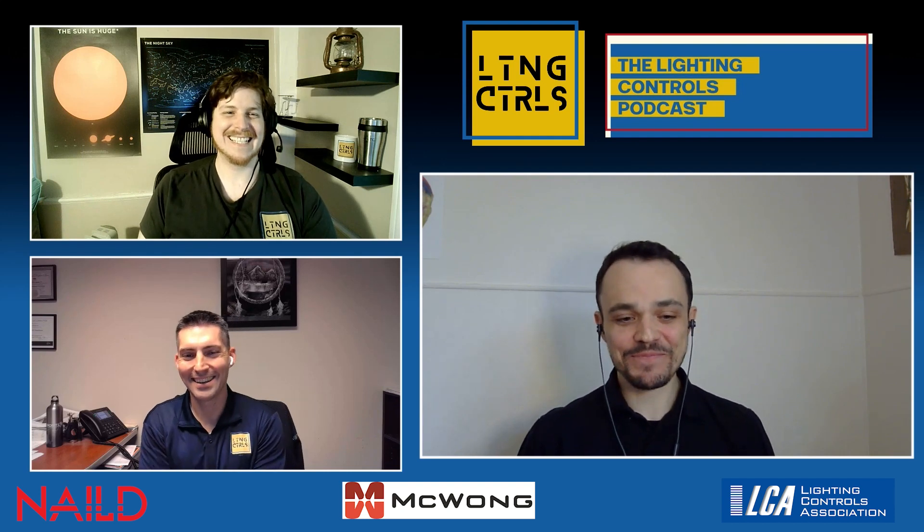Agreed. It is definitely flexing lighting controls — taking them, squeezing them, and really getting everything they can do out of them through building automation and intelligence. You get to find different types of opportunities based on what the building is trying to do, with all sorts of wonderful sensors and toys. For example, people counters — if you have a ballroom convention hall, after a certain number of people have entered and ambient noise is something, maybe we're not concerned about fan speeds, so let's kick up the fans. Another 50 people in — kick it up another 5%.